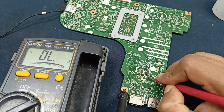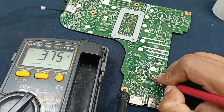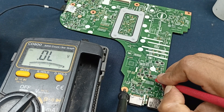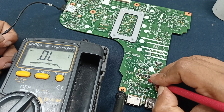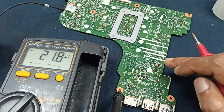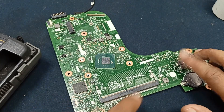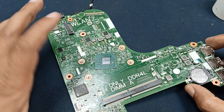You can see here should be 5 volts. My meter scale is set and I am going to power up here. You can see here is 5 volts. But here is 2.8 volts — it should be 3.3 volts. This coil and this CPU is going overheated.